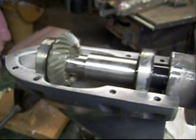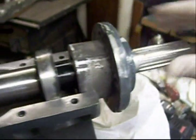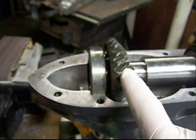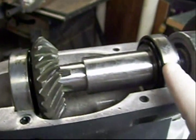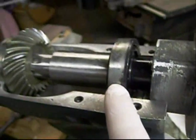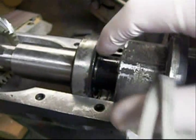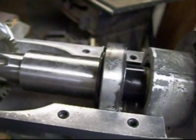Here's the inside of our drive leg skeg. We've got the aft fitting where the shaft seals go, and here's the first bearing, shaft, there's the gear, and the next bearing. These are beveled bearings in this one. Apparently they changed from roller bearings or some other system to beveled. Right in here I have a little electrical tape on the shaft just to keep the bearing surface from getting nicked while I'm messing around with it.